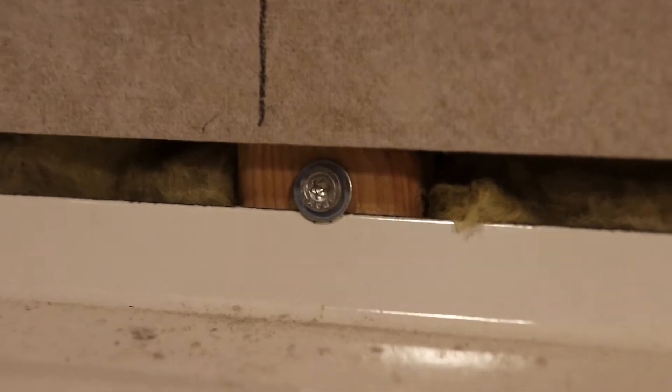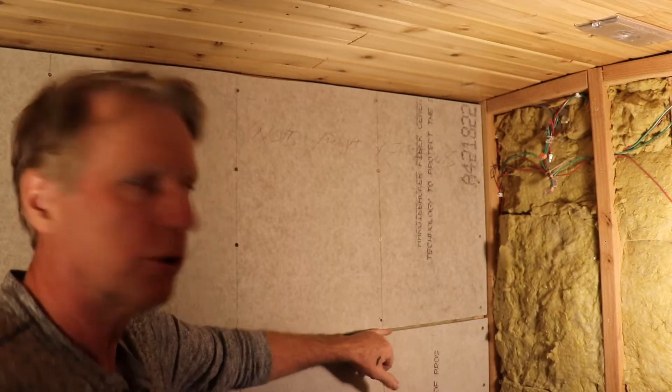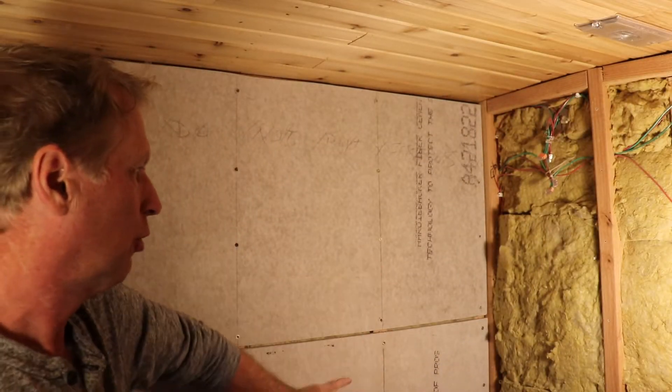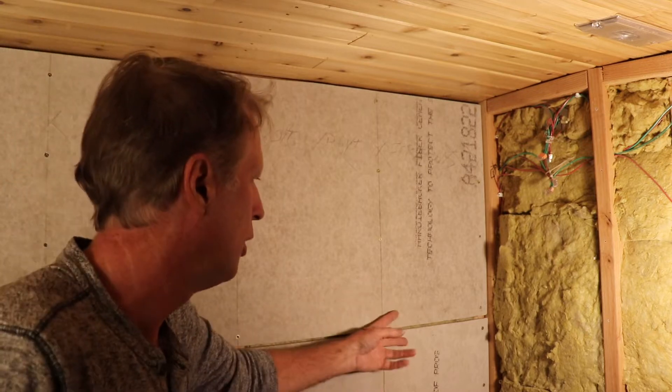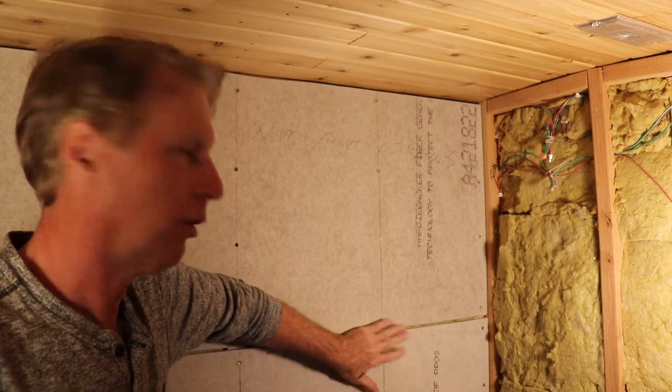To fill the gap between the bathtub and the cement board, I used quick-setting cement on top of the tape, then leveled it with thinset. It's pretty important to have about a quarter-inch gap between your sheets of cement board so that when you put your thinset and mesh in, the mortar has something to lock into.